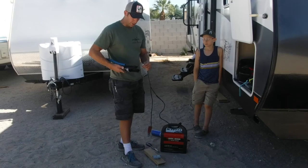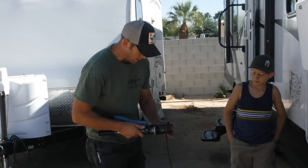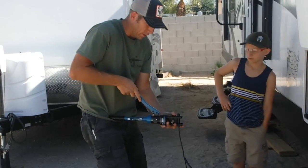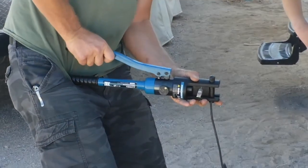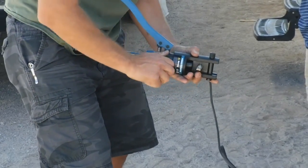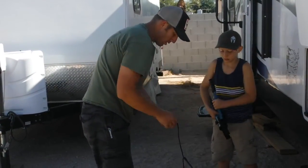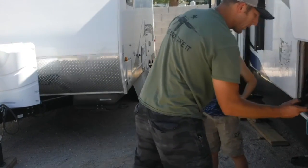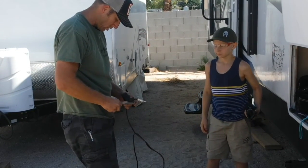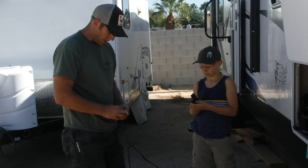Our Anderson connector is all cooled down now. We're going to go ahead and do a mechanical crimp on here also. Using the TH005 battery crimper — we had to use a slightly larger jig than we used for the battery bank side. Now we have two different ways of making sure that connection stays on there. Then we'll grab a piece of heat shrink tubing.